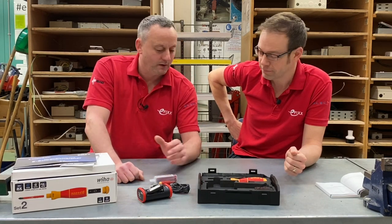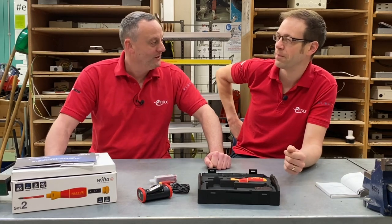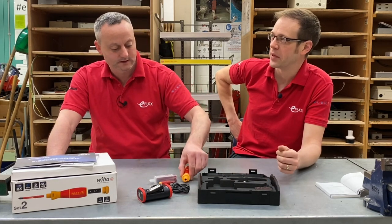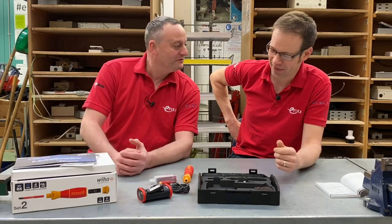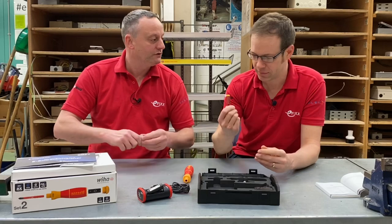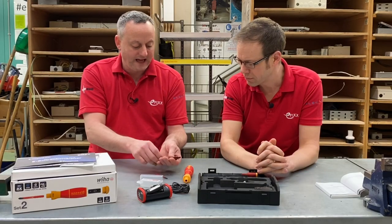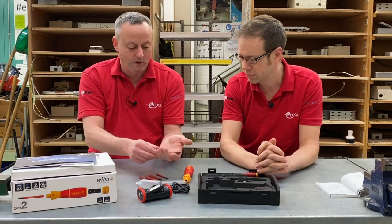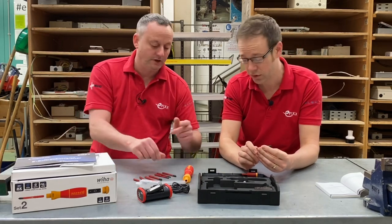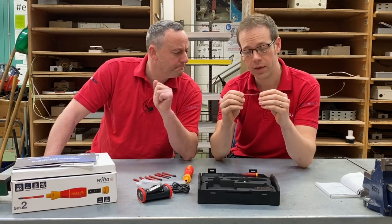However, when you start to use it, one thing that caught my attention — it's got a maximum motor power of 0.4 Newton metres of torque. Thinking about how that fits with connecting up a consumer unit, you're looking at 1.7 Newton metres for an earth or neutral bar, and certainly into the twos for other connections. We've got various screwdriver bits: flat heads, Pozidriv one and two, and the slotted Pozi one and two specifically designed for consumer units, which covers the earth bar, neutral bar, and the breakers.